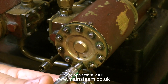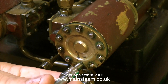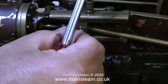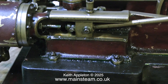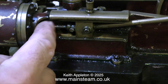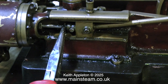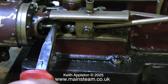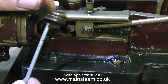So I carry on and remove all the nuts that come off — sometimes they come out with the stud, but that's not a problem. Now the cylinder cover's been removed, it's time to remove the piston. The piston rod is held into the crosshead with a simple pinch bolt. It seems to do the trick, but it's not the way I would do it. Having said that, this is just an ornamental steam engine — it's not designed to do hard work. So a steel bolt threaded into the crosshead pressing on a nickel silver piston rod is more than sufficient to hold the piston to the crosshead. And here's the piston.